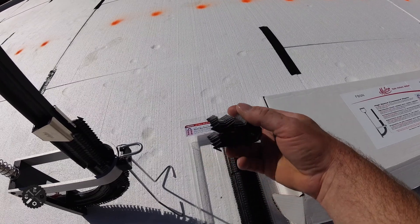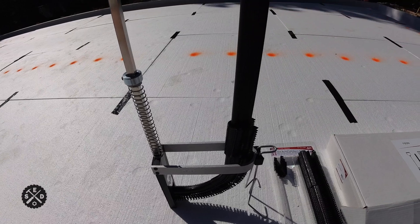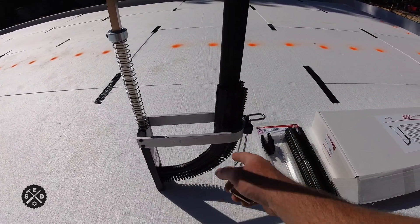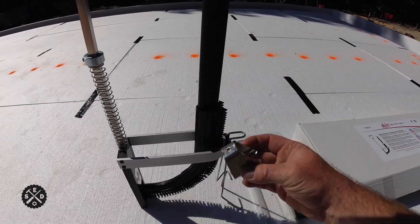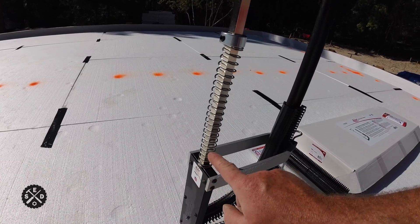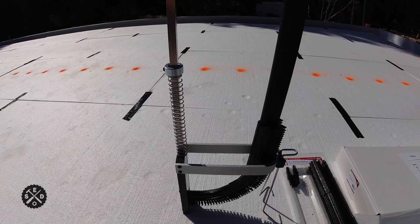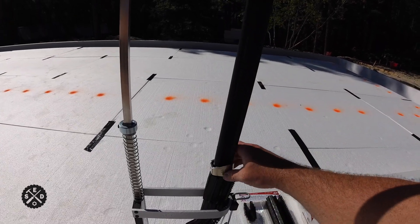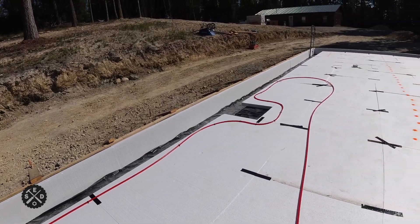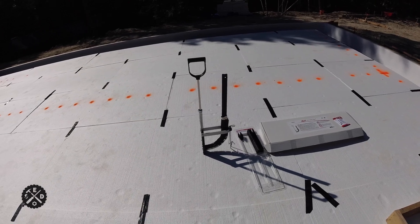The staples have double barbs so they hold really well and tight. It has a kickstand when you're not using it — just slides up and down. There's a weight to hold the staples on. They say to fill it up to a minimum level so it feeds properly. One thing I found right away: the first staple went in and the second and third jammed. I put WD-40 inside and worked it really well — I think it just needed lubing since it was brand new. Now it's been feeding great with no issues. I'm putting staples about every two feet, doing them closer together around bends.